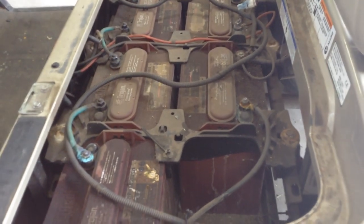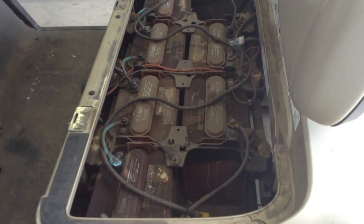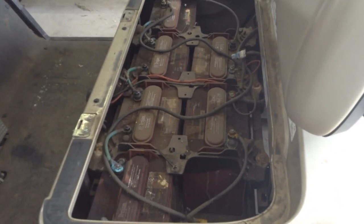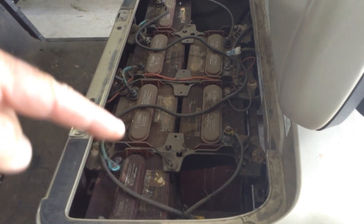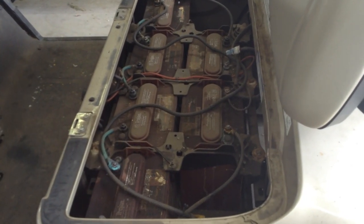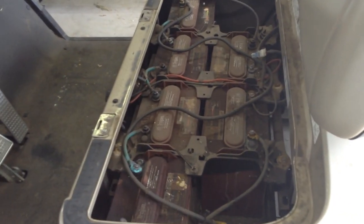It's going to be just a quick video to show you how to maintain your terminals, to get longer between cleanings and better life out of your batteries. Because if the cables are poor here and the power can't travel, it poses resistance — they get hot, and that's what starts the cycle of needing new batteries: not charging, draining batteries, weak batteries, that sort of thing.